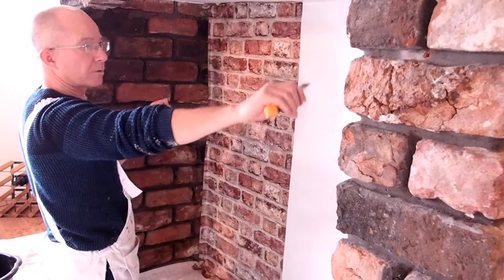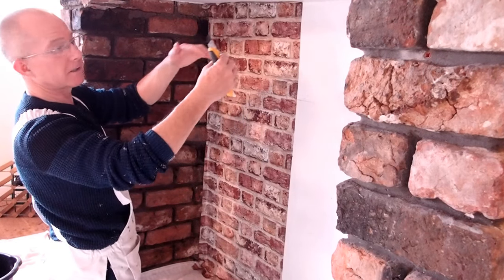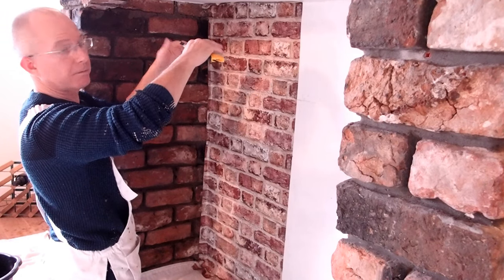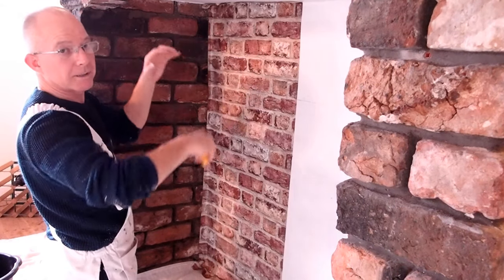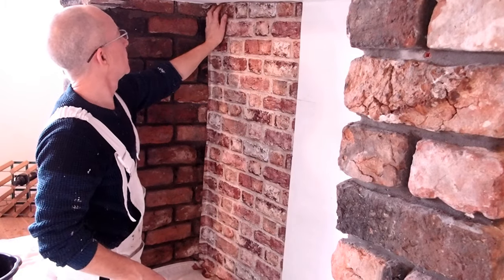And if you cut the paper straight and then stick it back, you have little gaps missing, or it's like an optical illusion, as if you've cut too much paper off. So usually following ceiling lines, if they're not that out, is the best way, rather than using a full straight edge.